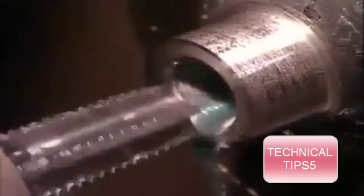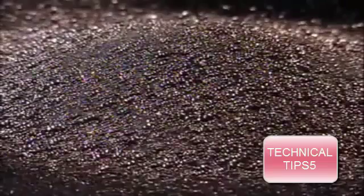A cutting tool carves open the neck and cuts threads inside it. This provides the best seal when the valve screws into the neck. Workers clean the cylinder's surface using a process called shot blasting. A machine shoots tiny steel pellets at the cylinders at very high speed.